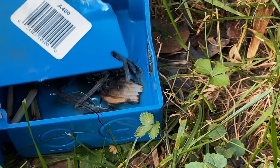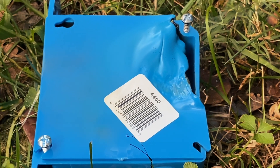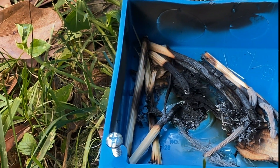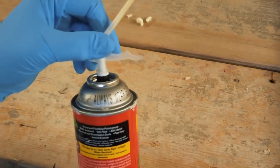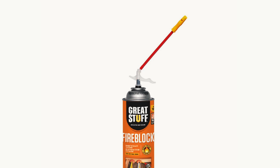As a matter of fact, when I put the lid on, the fire actually went out. I also covered this topic in my drywall inspection video — there's a link to it at the end. That is why it's also important to use fire resistant foam to close all openings in the box to reduce and eliminate oxygen flow.